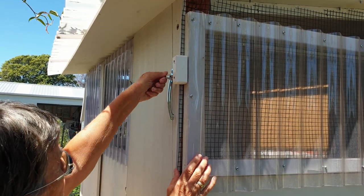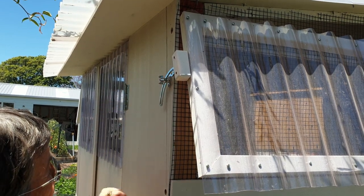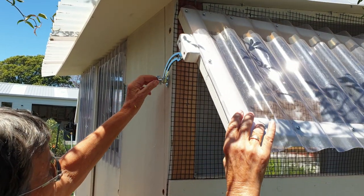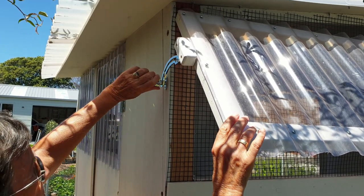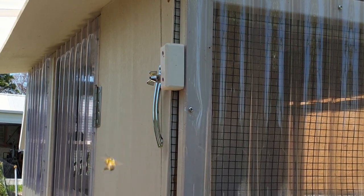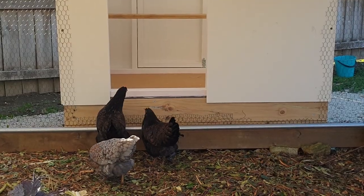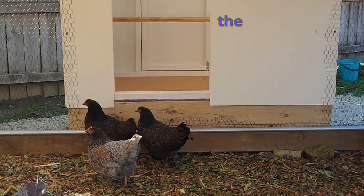We eventually found these window stays, which do just what I wanted, but because of the geometry of the way they open, we had to add a little block of wood on the outside of the wall and attach the window stay to the block. Now they work perfectly.